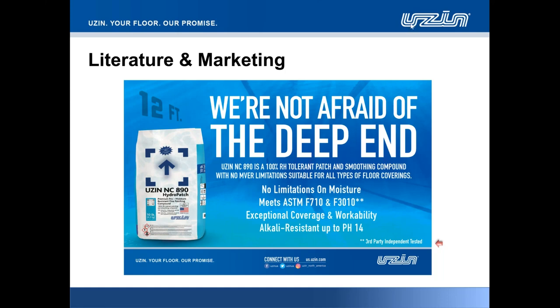So in addition to addressing ASTM F710 and F3010 and their relevance, I'd like to start with addressing the term moisture resistance and how it applies to a cementitious patch. This term is not yet defined by our industry, and as of today, it is open for interpretation. So I would just like to share the UZIN perspective of what it means for us and how it played a role in the design of this product. There are other patching products on the market that claim to be moisture resistant. However, very few details are available of what makes them moisture resistant.